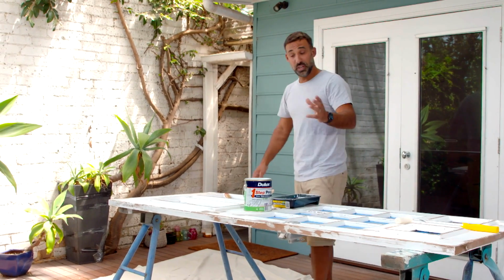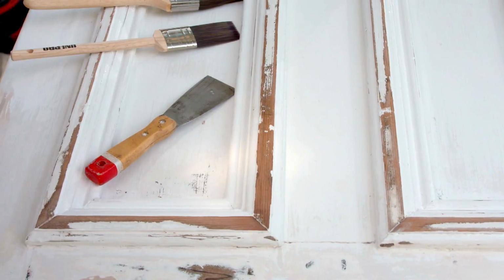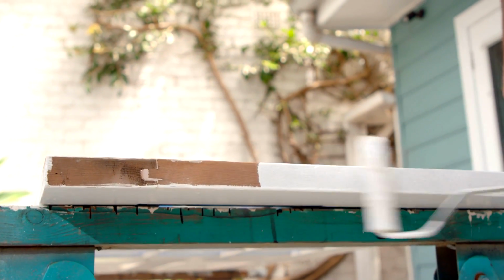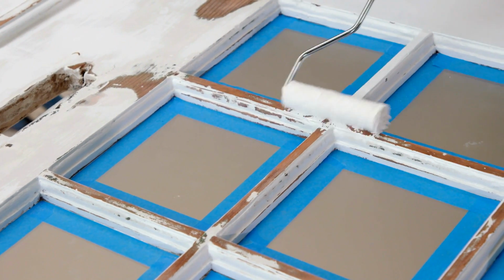With the door prepped, the first thing you'll notice is now we have a lot of bare timber. That means we need to go over the whole lot with a sealer and undercoat. You want to make sure that you get under this door's edge and on top as well, because that's going to stop moisture from getting sucked in and rotting out the door.